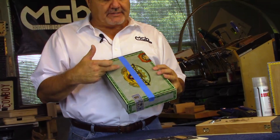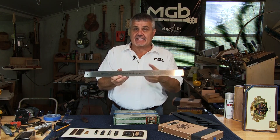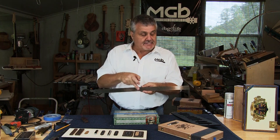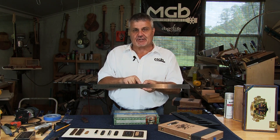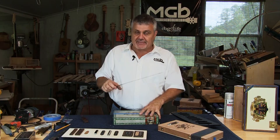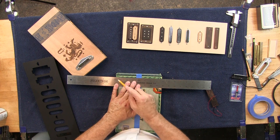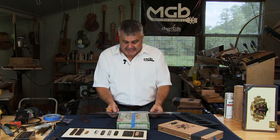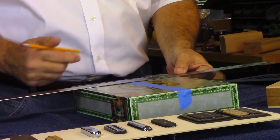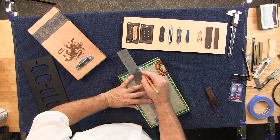Now back to this box where we're going to put the opening. I've got the tape down the center, and the next step is to mark a center line down the center of the box. For that I use one of these center-finding rulers — a very handy tool. It's basically a 24-inch ruler, 0 to 24 on the lower half, but on the top half you have two 12-inch rulers that start at 0 in the center and count outward. You lay it on the box and find the center by slowly adjusting from one side to the next, making sure you're about in the center, then put a mark there. Come down and do the same operation at the other end, getting the same numbers on both sides. Now you have two marks for the center, and you lay the ruler down to mark a center line down the center of the box.